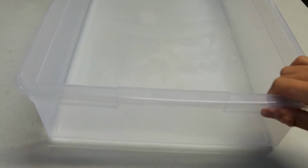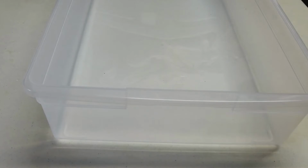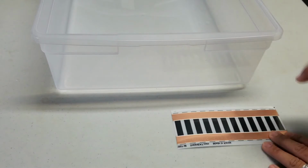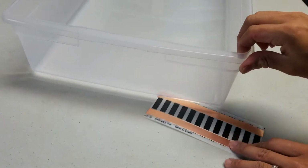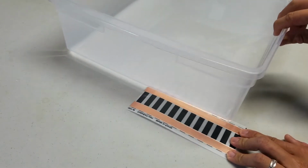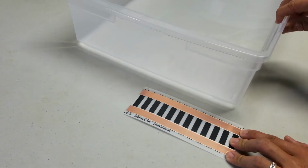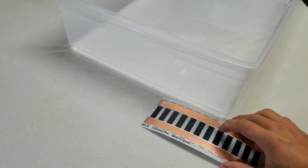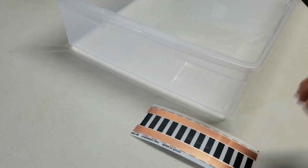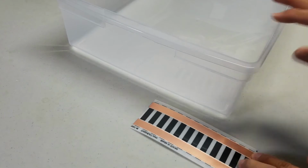Now the tubs that I'm going to be using for this particular build, you can see has these little feet at the bottom. It's got one on each corner. So imagine this being the back, and if we use the same idea as earlier, a heat tape that extends the full length and extending a little bit beyond the side, that won't work in this case because the feet are going to, as you can see, you can hear that clicking sound. That's because it's catching on the heat tape as it slides back and forth. Now, even though I can put metal tape or metal foil, it'll help a little bit, but it's unnecessary risk.